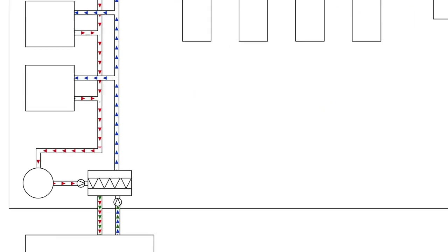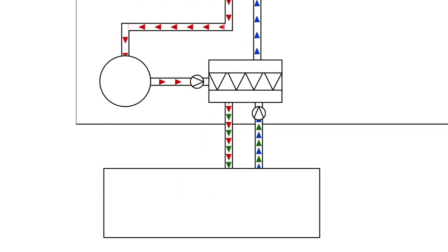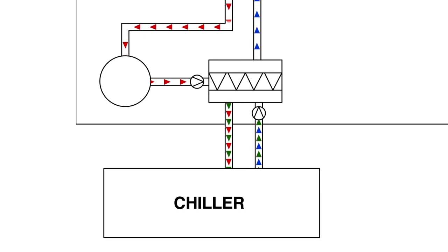The location of the chiller is outdoors. It's an air-cooled chiller, outdoors at ground level, or the same level as the plant. They were not able to put it on a roof. Had they been able to put it on the roof, we may not have needed to go with a glycol loop, because you can drain down all the water into a tank when the chiller is turned off.